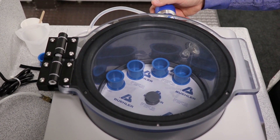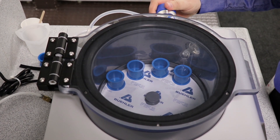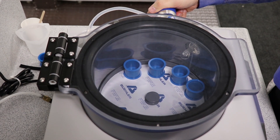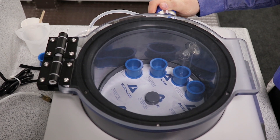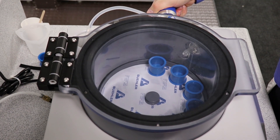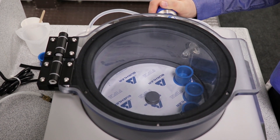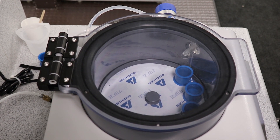Pouring multiple samples is very straightforward. We release the valve, fill the sample with epoxy, and then use the adjustment wheel to move to the next specimen and release. We repeat this for each next specimen in turn. As you can see, the epoxy can be dispensed in a very controllable way.